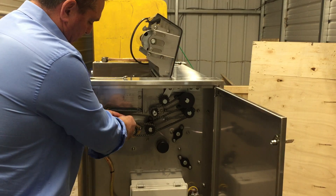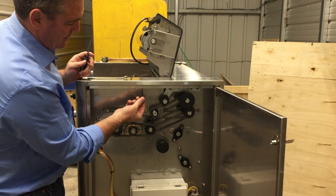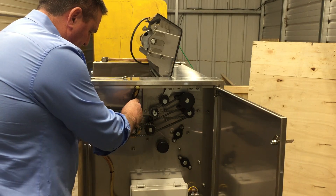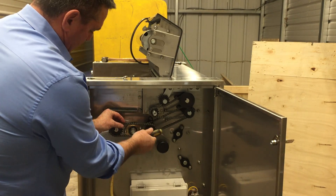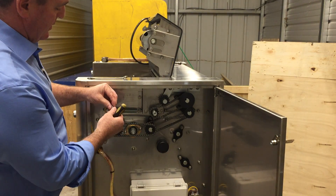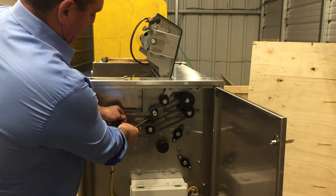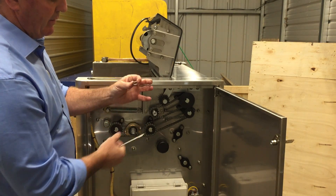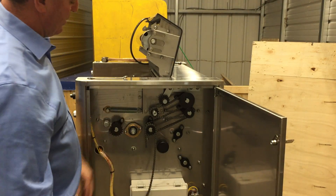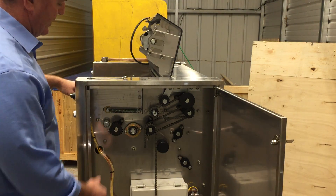This is the key that locks the key link. Once you've got that off, you take off the next piece and put it aside — don't lose it. Then the whole link just slides right out the back. Now the chain is broken, so we can just take the chain right off that sprocket.